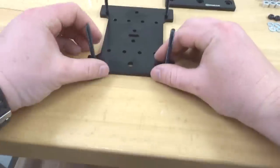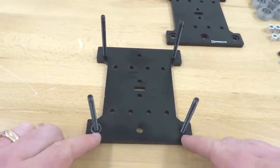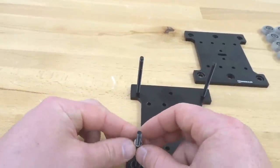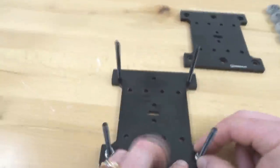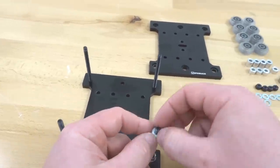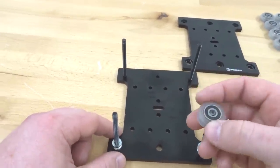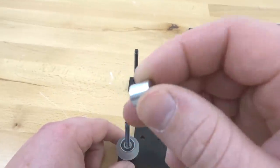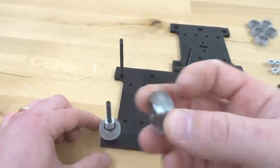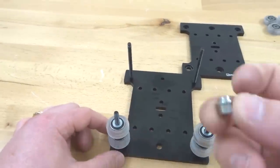Tilt your plate over and set it to its back so we can start our wheel assembly. Starting with the bottom portion first for our eccentrics, make sure our marked side is facing us, away from our fixed wheels. Slide those onto place on each screw. In addition to this, add our precision shims right on top of the eccentrics for both screws, then add our assembled wheels on top of the precision shims, followed by our 9 millimeter aluminum spacer — which spaces between our two wheels for our dual wheel configuration.